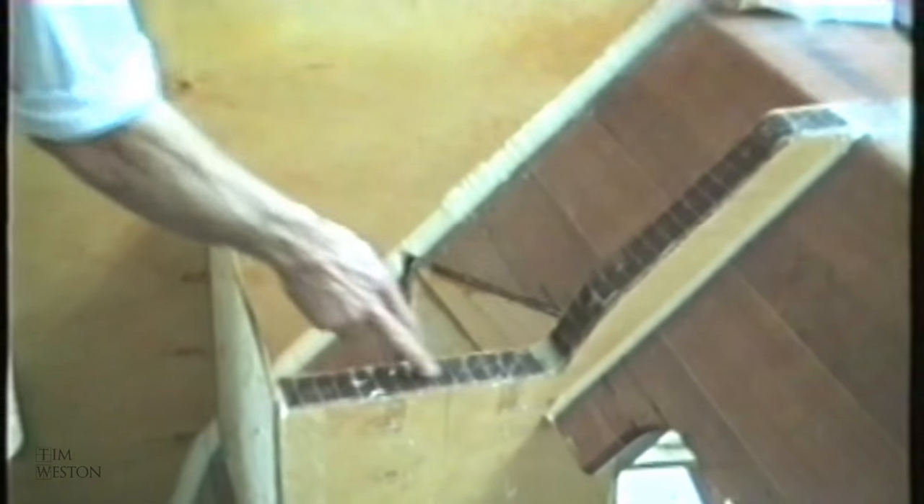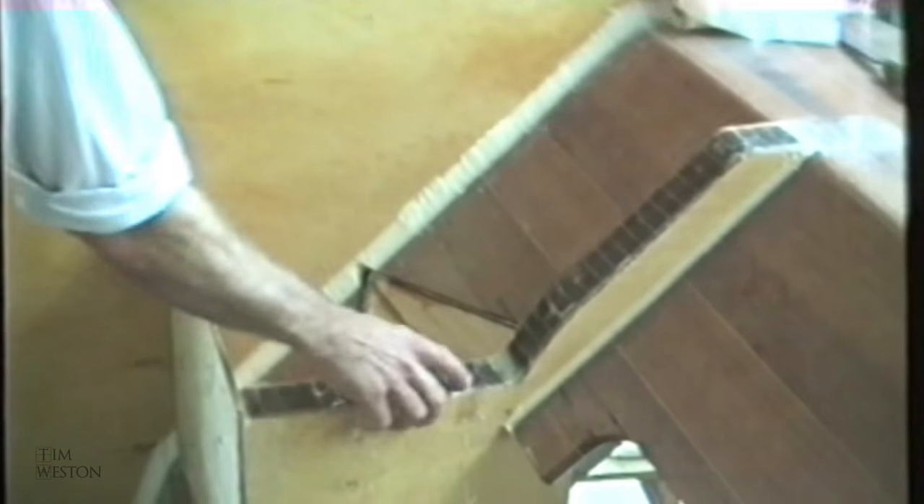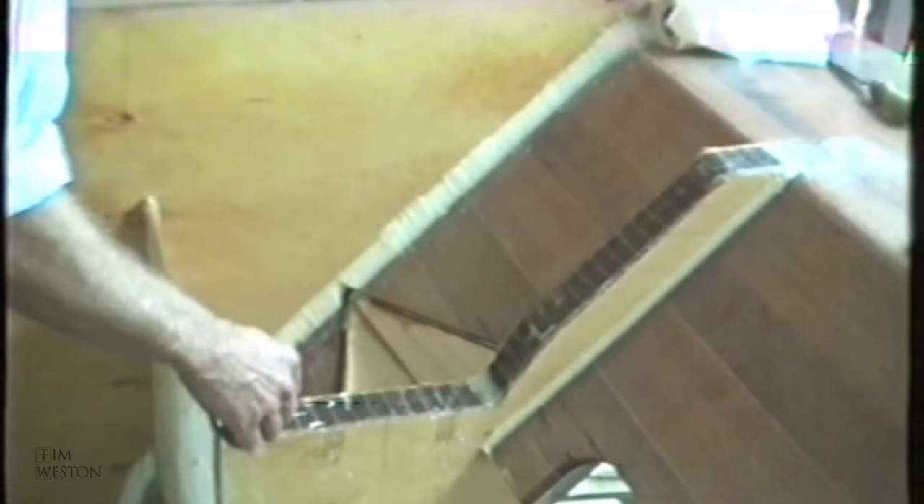You'll have another one on the other hull, similar? Yeah, that's right. If you come inside I'll show you around. There's the engine mount — it's laminated up out of a core of western red cedar with fiberglass and plywood on both sides. Uni-glass top and bottom laminated onto the hull gives you quite a solid mounting there. That's your main thrust then? Yeah, it takes all your engine thrust.